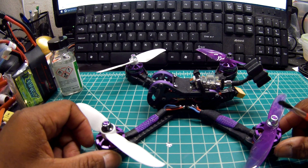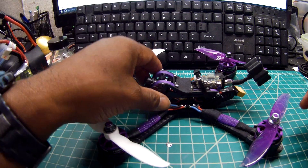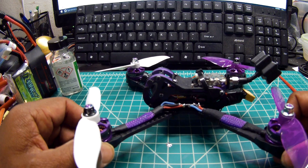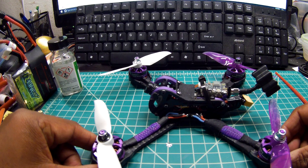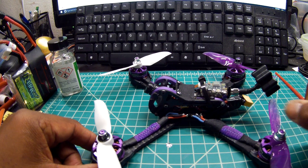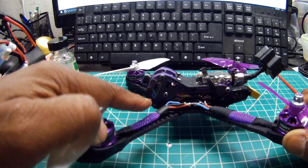The visuals aren't that great because it was at night, so I started losing focus, did a bunch of crashes, and it still held up. Starting out with the frame — you can see it's got those metal protection guards. What they actually protect is limited, because the way I have everything crammed in here, they're not protecting any of the major components you'd care about while flying, namely your VTX. You can literally destroy that in a crash over concrete, and the camera too. You can't jam it too far back because of where that screw is.